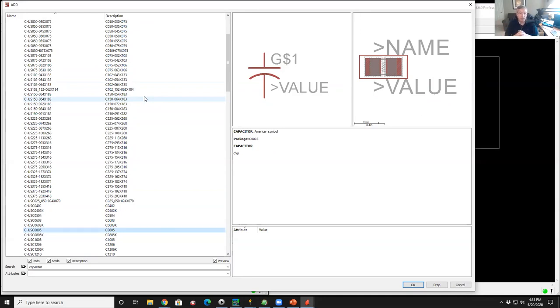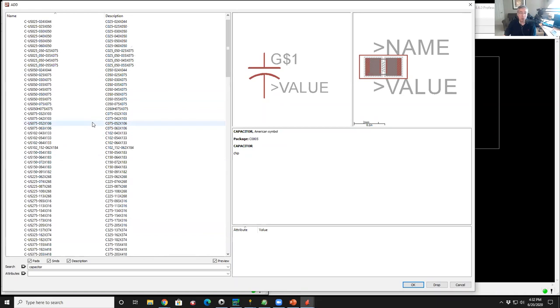Like a resistor: an eighth watt, a quarter watt, a half watt, a 1 watt, a 5 watt, all those resistors are physically larger because they have to dissipate more heat. And so that's why you have a zillion different shapes. For circuits that don't require handling a lot of current, you can use smaller footprint parts. That's perfectly fine. When you're dealing with higher power, then sometimes you'll have to use larger components to handle it. So we're going to make a through hole part or board to keep it kind of simple.